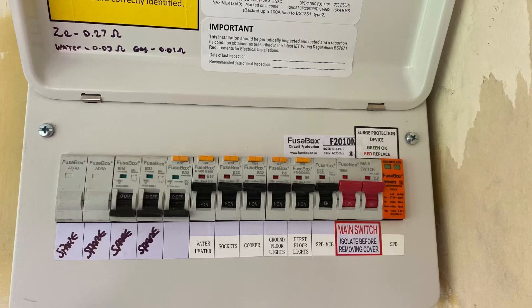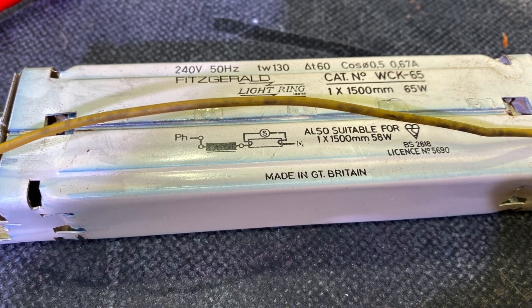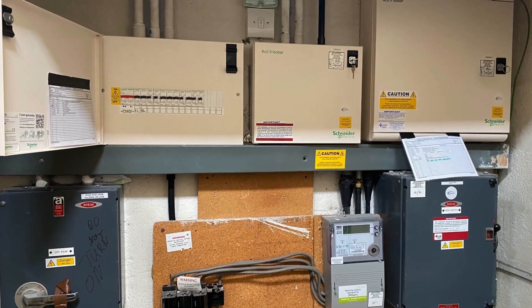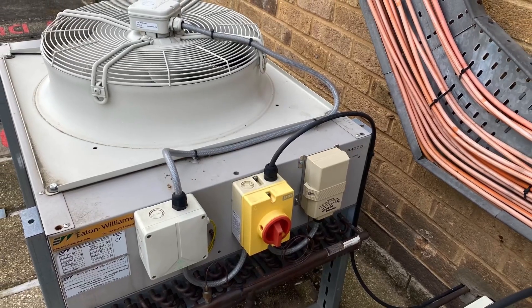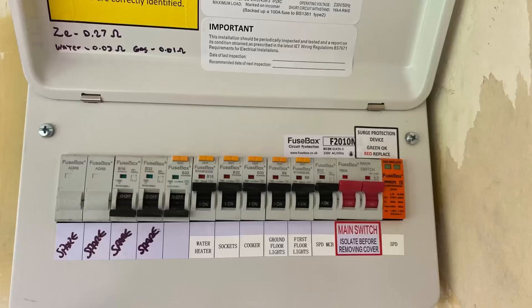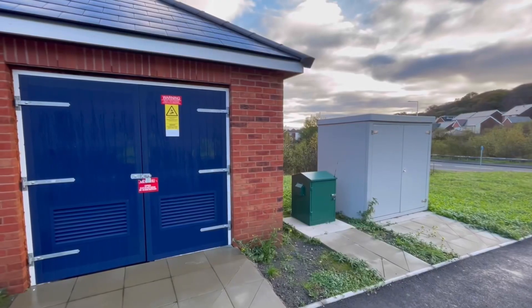The other cause is switching loads. We've talked before about when we have a magnetic ballast within a fluorescent light fitting that drops a back EMF across the tube. Imagine you were near some industrial work — maybe near a factory unit with lots of motors which are inductive loads — and they were turned off. That could effectively drop a higher voltage back into the system, and the 230 volt nominal voltage could appear in your installation as a surge, causing damage to your electronic components.